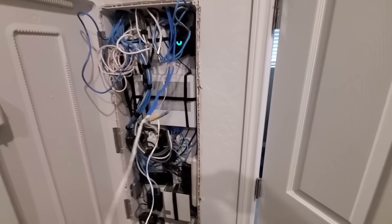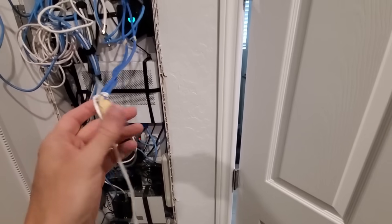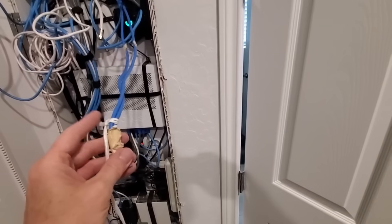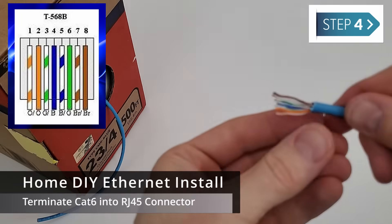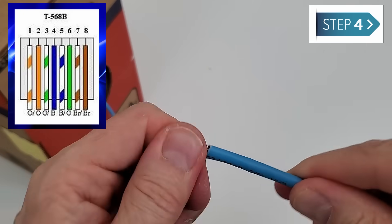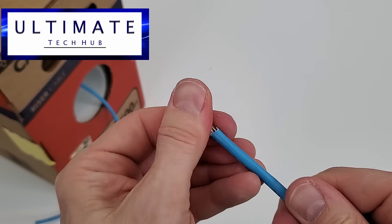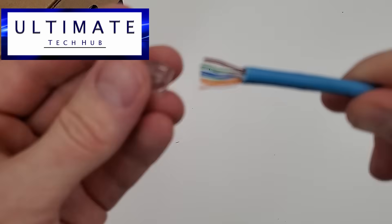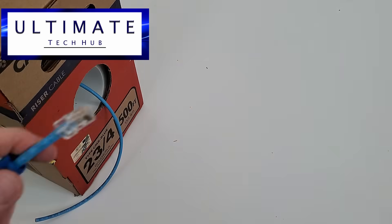I saved money by not using that $40 tool. I have two wires here — I do want to do two more but not today, as the attic's about 100 degrees. All we have left to do is terminate these into RJ45 connectors, then I'll plug it into my TP-Link 8-port switch. I'll show you a clip from a previous video on how to terminate Cat6 cables. We're using the T568B wiring diagram — just make sure those wires are flat, straight, and in the correct order before you put it into the RJ45 connector. You will need a crimping tool to complete this process.